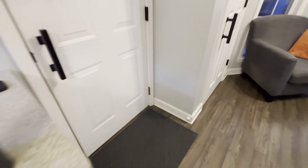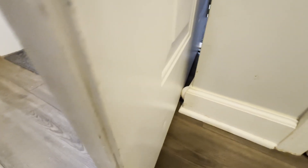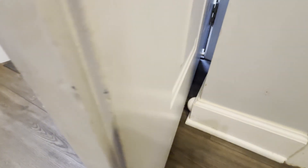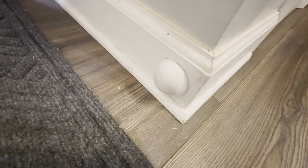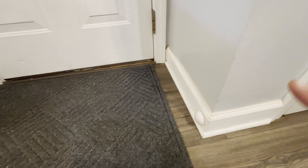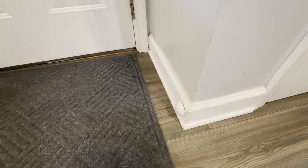Let's take a quick look at this door. Down at the bottom we've got this little bumper that keeps us from hitting the trim or the wall. I like the spacing of the bumper and I don't want to change that. So we're going to keep that bumper effect, but when the door hits open, I want it to hold open using magnets. We're going to duplicate that bumper geometry with a TPU piece at just the right angle so that when the door is fully open, magnets take over.